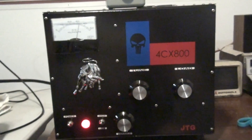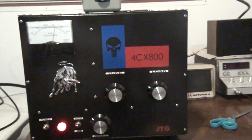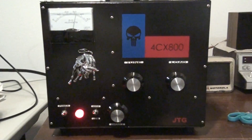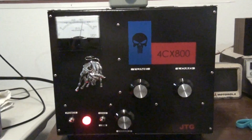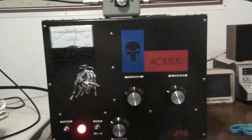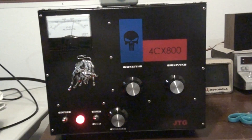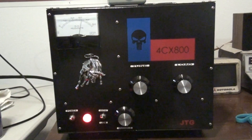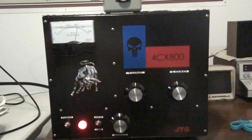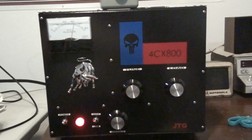When you have one of these built, he'll say: how much power average is your radio doing? Say 10 watts average — okay, we're going to custom build this amp for a 10 watts average radio. Any less than that, you'll see a little bit less power. Any more than that, you risk damaging the amp. Some people think, I can get away with it — it's only doing two watts more average. But two watts more average is a significant amount of power for this tube, because if you don't pad the drive down, this tube takes like half a watt or less to get max output. So you have to pad that tube down for our purposes. There's not a radio out there that does that much power, so these amps are custom made for that.